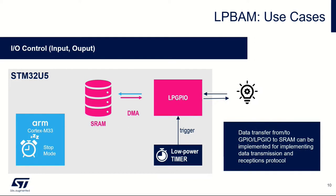We can drive GPIO or read GPIO. In this way, we could implement some other form of communication protocol — for example, we can toggle LEDs or implement simple UART transmissions, again in the low power domain, controlled by a linked list DMA channel that's triggered by a low power timer.